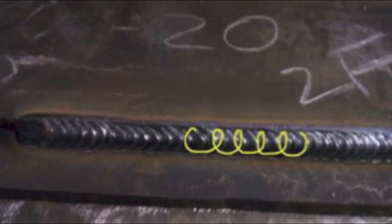For this particular piece I'm stacking beads — they call this padding beads or a pad of beads. I'm trying to overlap each bead halfway with the next bead. This is where to try little circles, little motions, little cursive e's — that's kind of my go-to method. You can also just trace the front of the puddle back and forth. As long as you keep the arc on the leading edge of the puddle, a lot of techniques can work for MIG short circuit welding. A slight pulling angle is probably the best choice when you're just getting started.